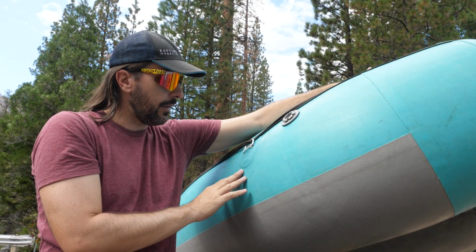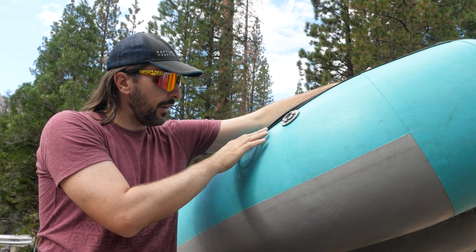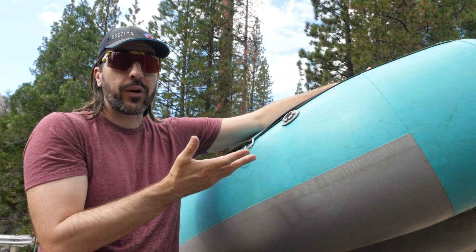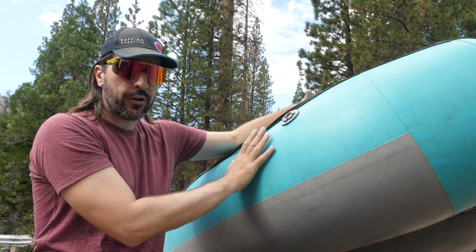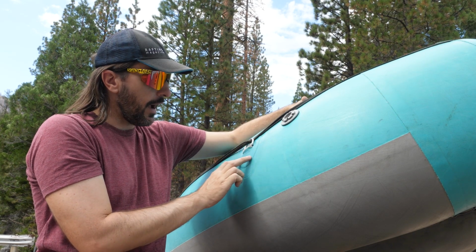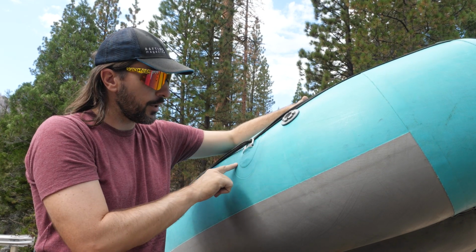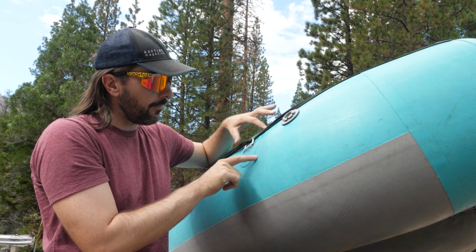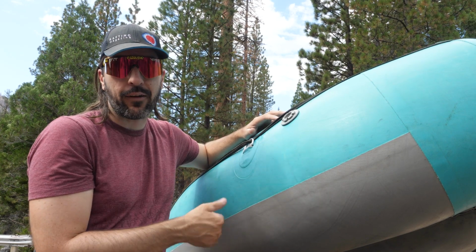When we look at the D-rings on this thing, they're kind of cool, and what was explained to me is that these D-rings aren't welded on from the outside. Air's a little hush-hush on this. It's all pretty proprietary, so I don't like to let this out too much, but they did tell me that this is just an outer shell piece that they put a cut in, and then on the back side they've welded the D-ring onto it. So you've got all the cam webbing from the D-ring right behind this, and then a patch welded on that. That's why there's this depression here. That's going to prevent this from tearing all the way out, or if it does tear, it's only going to tear to the periphery of this weld right here. And it's pretty easy to patch in case there was an issue, because again, you can take the bladders out and get inside there and work on it.